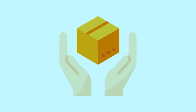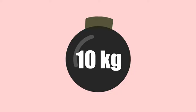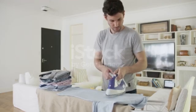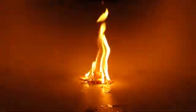Make sure you do it properly without moving the paper. Put about 10 kg of weight on it and keep it for about 9 minutes for a perfect print. Also give the iron a break every 3 minutes so as not to destroy the paper or the iron.